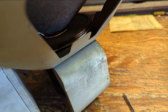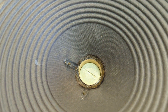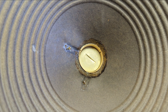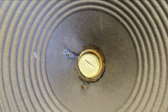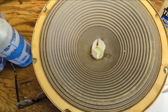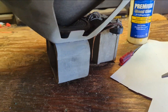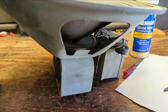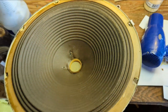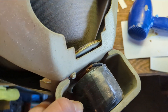I've got everything loosened up — you can see that's going around a little bit. I'm going to cut out my pieces of paper and completely line that gap so it'll be perfectly centered. Then we'll glue down the spider, tighten the bolts, and see if it's centered. Then we'll pull the shims out. Shims are in place — the cone should be centered. Now it's time to start gluing the spider back together. Everything's glued up. Even the surround was coming loose, so I had to glue that back down too. It doesn't seem to be rubbing — we'll not know until we put it back in the radio and see what happens.